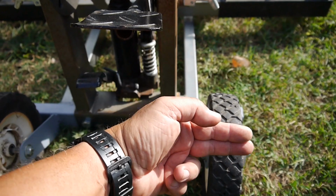I'm learning. You can see my welding. It's getting a little better. I still kind of suck at it, I think, but I don't know. I think I need to get a better welder and then test my skills on it. Because when I was feeding the line through it on the welder, I noticed the line feed was actually pulsing. So it's not a steady wire feed, and maybe that's why I'm getting some bulges here and there, because it's pulsing when it's coming out.